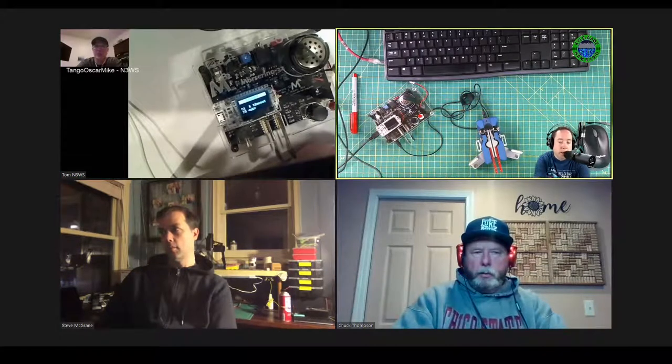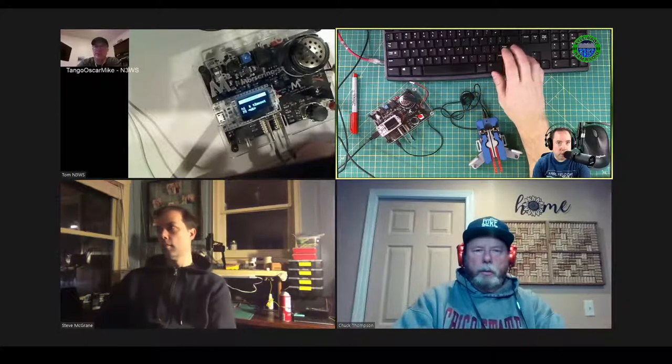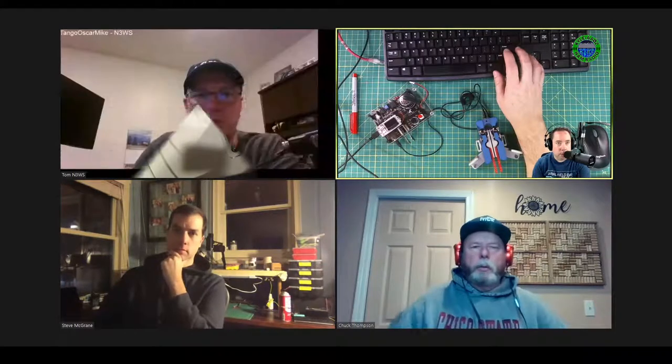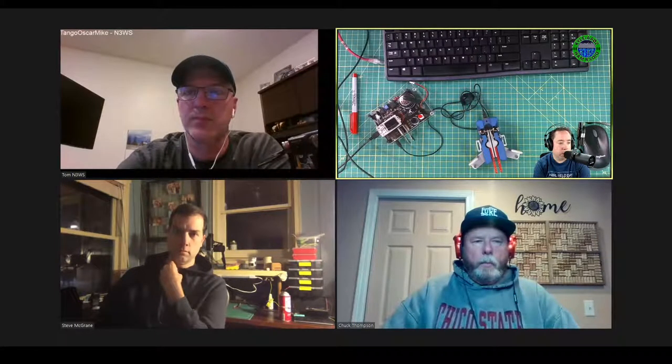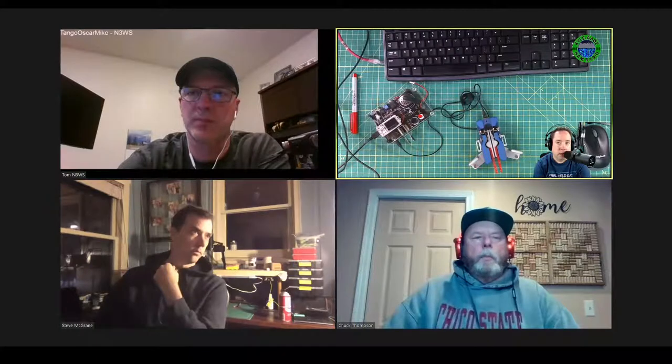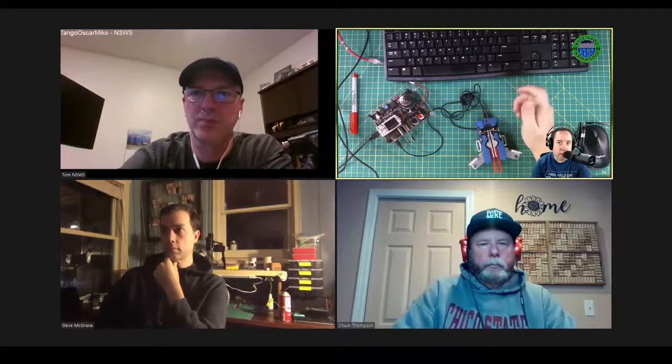Now, is it hardware? Right now it is keyboard-based. You use your keyboard, like I'm doing on my keyboard here, with either the left, right, or the brackets. But there is a piece of hardware that you can buy that helps support the server that it runs on. I think it's like $25 or $30. You plug your keyer into it, and you plug it in the USB port on the back of your computer, and it simulates the keyboard tapping back and forth on whatever keys you designate, and it sends. So you can do left paddle for left bracket, and right paddle for right bracket.